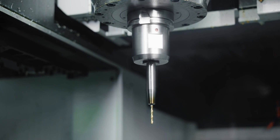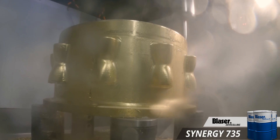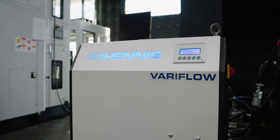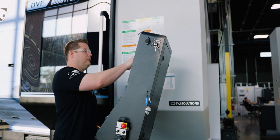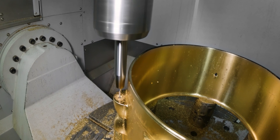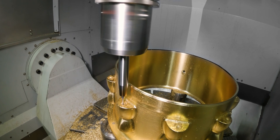Now we can come in and do our threaded holes. We're going to drill, chamfer, and thread mill these 12-24 holes. We've got to be careful and use shrink-fit extensions for basically all of this because these holes are very close to the outer diameter. I'm going to run through-spindle coolant on this drill because the last thing I want to do is catch a chip and break this drill when I only have one part to run. Speaking of coolant, we actually partnered with Hennig and replaced all of our high-pressure units on our machines with the Hennig Veriflow high-pressure system with programmable set points up to 1,000 PSI — and so far we are absolutely loving this system. To thread these holes I'm using a single-point thread mill, which is going to take longer than if I would have just tapped it. But because these holes are so close to the diameter and these threads are also very deep — they wanted at least a three-times-D thread depth — I just chose to go with a single-point thread mill. It adds a little bit of cycle time, but it's going to be a much safer process.